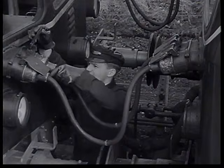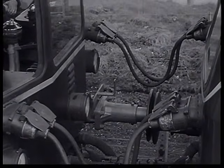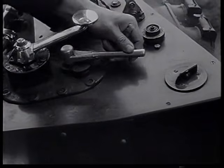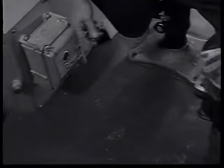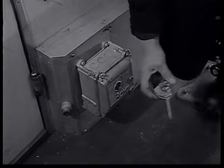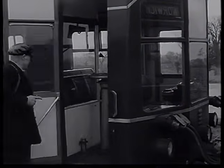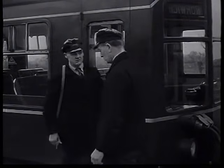Up to four 2-car sets with a maximum of 8 engines may be coupled together, and the procedure in each case is the same as you have just seen. In the cab of the second train, the brake handle, reversing lever, and control circuit key are put into the satchel and both cab doors locked by the driver going off. He should take his satchel with him.